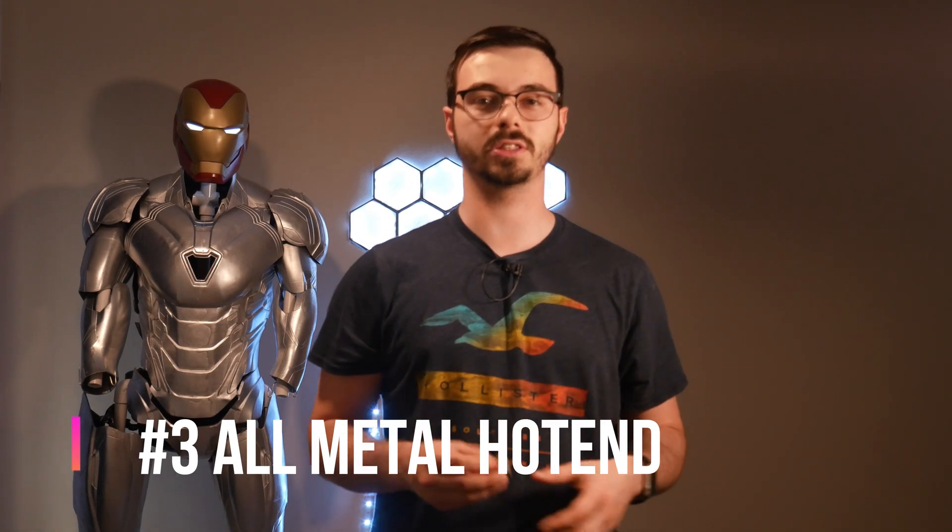This next one is a very interesting, subjective topic. All metal hot ends is an upgrade I did do for my 3D printer — I used a Swiss one, and the link is in the description. My printer model comes with an annoying proprietary nozzle thread, and one of my previous nozzles broke and I couldn't replace it, so I decided to replace the whole hot end. These are a little more pricey, coming from 70 to a hundred dollars. What it does is keep your prints clean and efficient, heats up a little quicker, and more importantly, lets you change your nozzle tips freely.